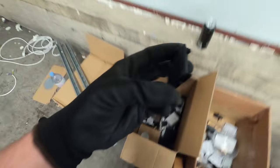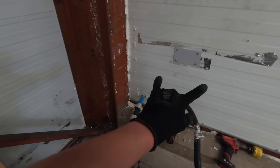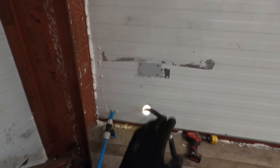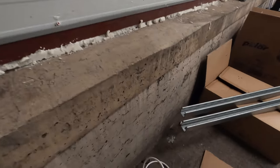Right, so we're just waiting for these to dry. We have got end caps as well — I prefer the white ones when using Hager gear because it matches a bit better, just me being picky. Once these are dry, we'll get the end caps on. So we're going to mark these out — they're going to sit 365mm apart starting from this mark here, rising up, which will give us somewhere to mount the DB and also somewhere to mount the trunking top and bottom. We'll just need little feet for the vertical trunking rising up. We're missing a few bits — missing the SPD for the board and the contactors.